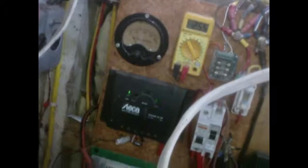Yesterday I kind of noticed, but today I really noticed earlier in the day, pretty much midday when the sun was right up and the batteries were fully charged, so we're in the PWM stage. The Steca charge controller here was playing up. Instead of being in PWM mode, which you would witness by this meter quivering around like that, it was bouncing up to nearly full current. The voltage was rising to 28.4 volts, and then it was shutting off, going back to zero of course, and staying there until the voltage fell to just under 26 volts. In other words, it was behaving like an on-off charge controller. And this ain't no on-off charge controller, this is a true PWM device. So I was going, what the fuck?